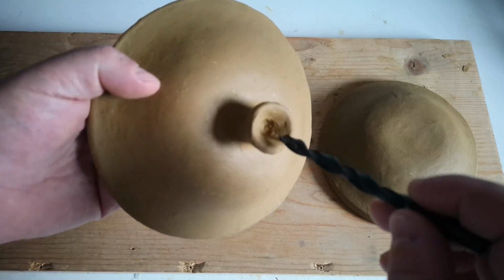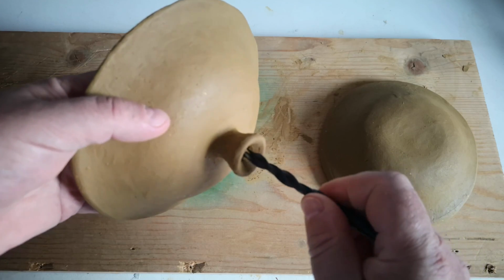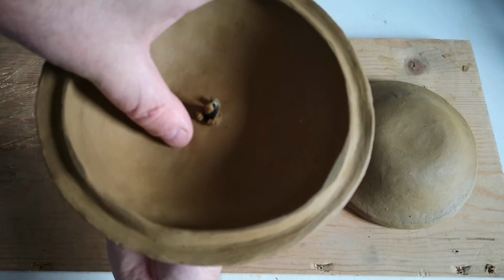The middle of the handle isn't the best place for all possible reasons, as it means the handle could get too hot to touch, but I'm assuming it would anyway. So the vent goes here. If I put it anywhere else, it will be asymmetric and it might introduce a fault that destroys the piece in firing.